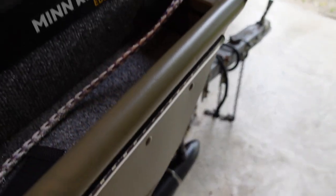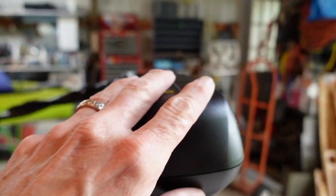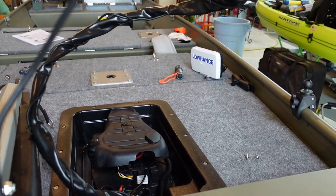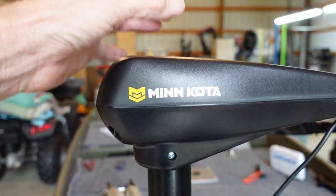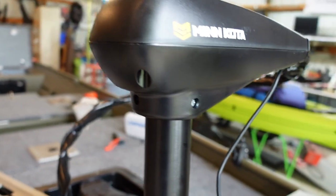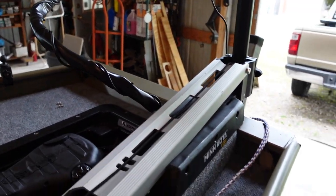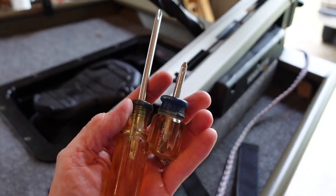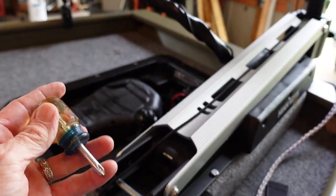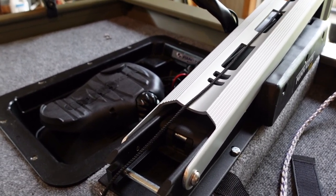So it's pretty easy. As I demonstrated, even a moron can do it. All you got to do is take the cover off the head, take the tension off the foot control, lift up that spline, turn it the direction you want, put it back down, re-tension, and you're ready to go. Only takes about five to eight minutes. The only tool you need is a Phillips head screwdriver — in my case a short one, because our foot control was mounted in a recessed tray. So there you have it folks, I hope this was helpful to you.